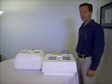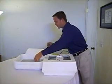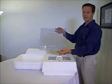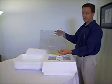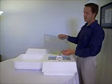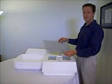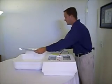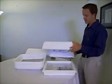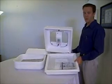Another significant difference is that the Hovabator incubator comes with a sanitary liner in the bottom. Underneath the wire rack there is a plastic liner that easily comes out, which has the water troughs to fill with water to control humidity. When you're done incubating, chicks can make a mess when they hatch and in their first few hours. This sanitary liner easily comes out, it's easy to clean, dry it, put it back in, and the bottom of your incubator is nice and clean and ready to go again. The Little Giant has built-in water troughs in the foam, but it does not have the sanitary plastic liner, so you have to clean the foam when you're done incubating.